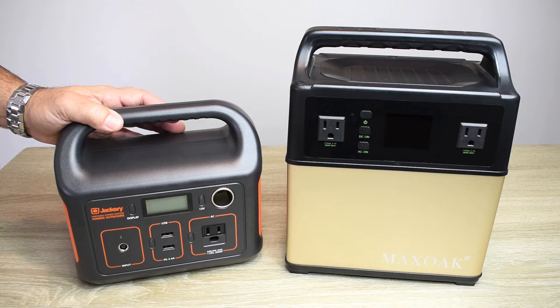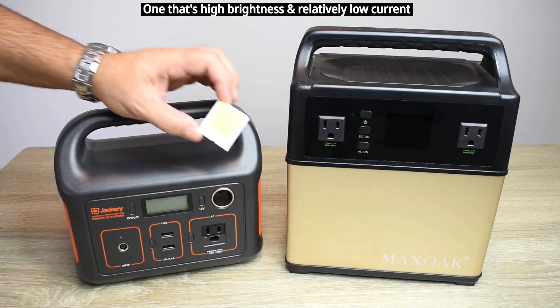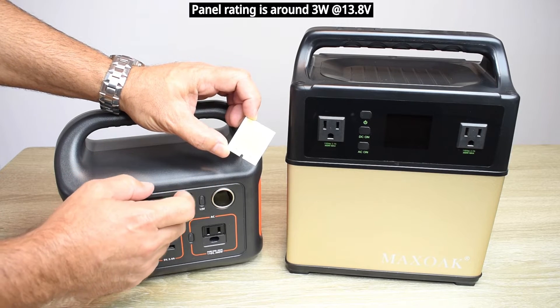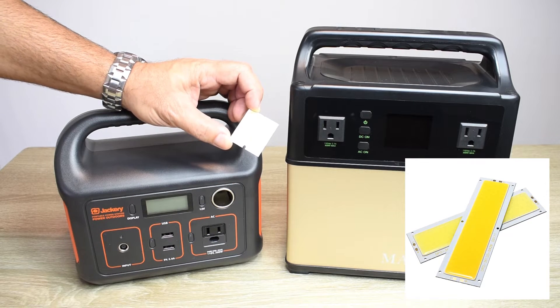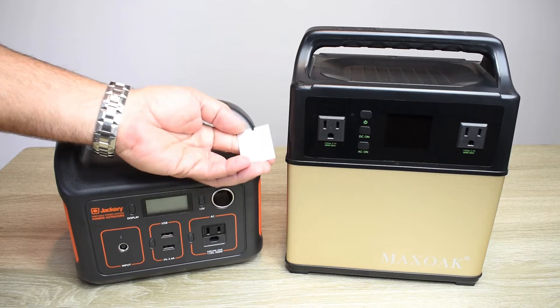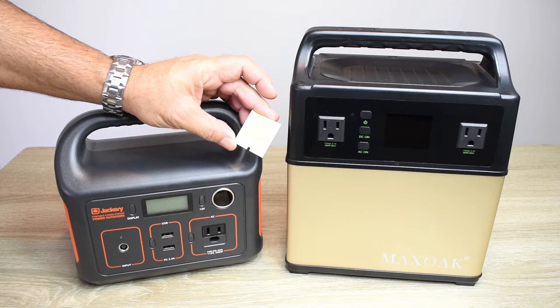So what I'm going to show you in this video is how to add a COB LED light panel to any of these units. The COB LED panel I'm using is this 12-volt panel right over here. You can also get this in a different shape, such as a rectangular strip. The good thing about these is that as long as you do not overdrive them, you do not have to put a heat sink on the back. I tested this one, and at around 12.5 volts it will not get too hot, and you can run it continuously.